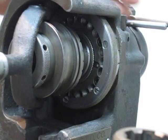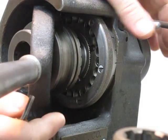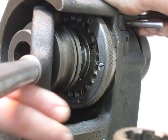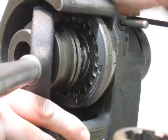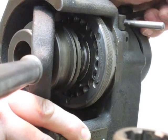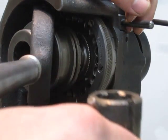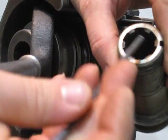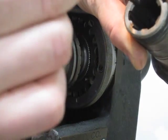When it comes time to actually use this thing, I crank it up and it locks into position. When I'm done the process, I pull the pin out, get it off axis a little bit — the pin is spring loaded, but it won't lock in until it gets to the next spot. I repeat my steps through my spline. Pull that out, get it off axis. So that gives me a surefire way to accurately index.